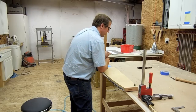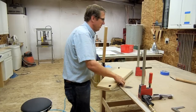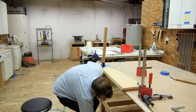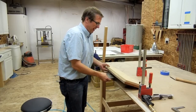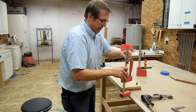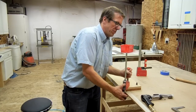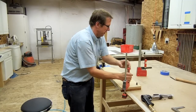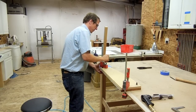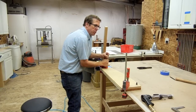One thing to know about using the flow form hammer, if you're doing this much, you're going to need a pretty big compressor. I happen to have a 10-horse compressor, luckily upstairs in my garage, so I don't have to hear the noise down here in the shop in the basement. But it's a two-stage compressor, and it can pretty much do a continuous flow for this rivet gun, which is really nice. A little pancake compressor would not be enough to do it. You'd have to be stopping quite a bit in between.